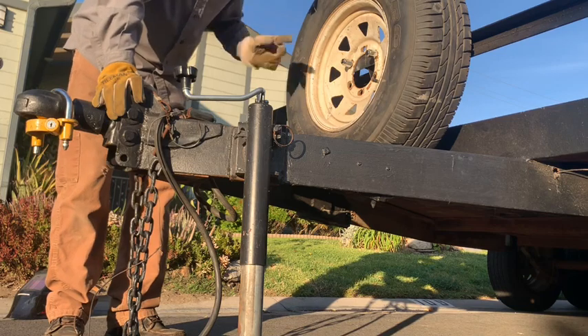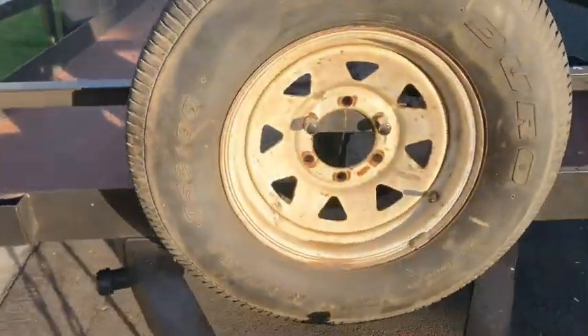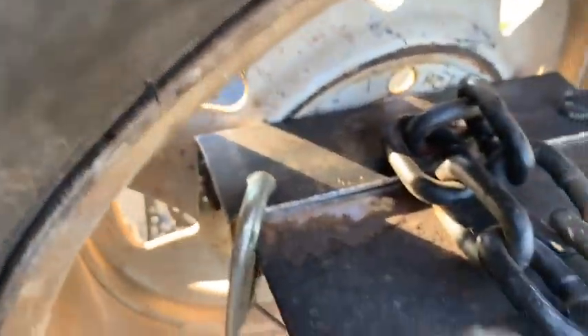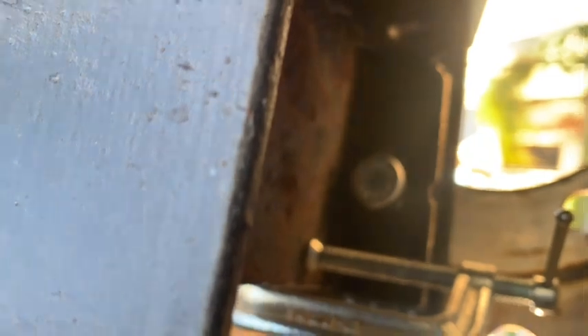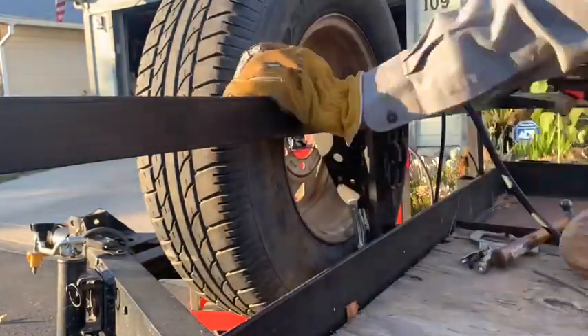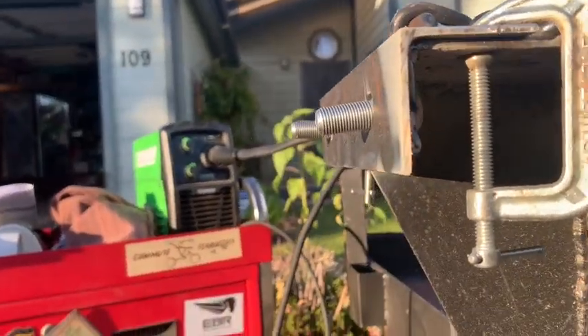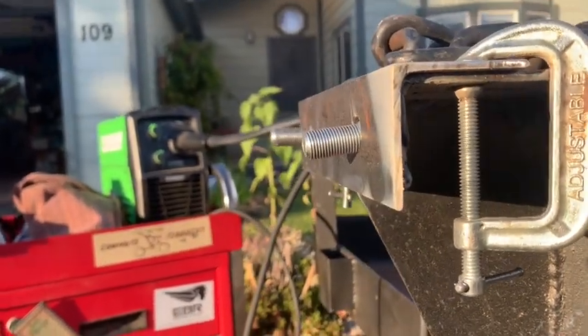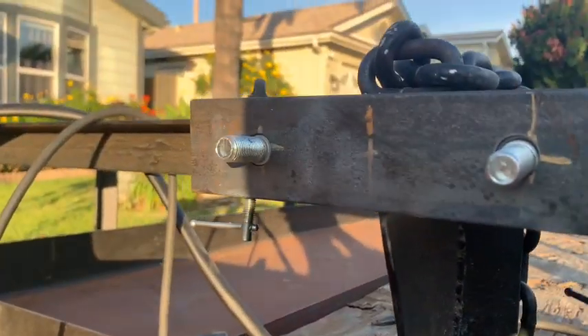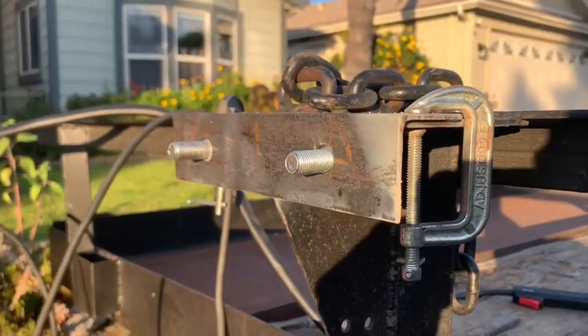We'll try to tack that place from the back side. I want to make sure we've got enough room around the bottom of the tire. I can tack these areas good, but it's getting back underneath there to tack the back side of the stud. We got a couple of tacks on there. That stud looks really cockeyed — I think I can tap it up. We know it mounts there but not the kind of precision I like to see. There we go, a block of wood straightened it out. Now we can pull the clamps and weld it up tight.